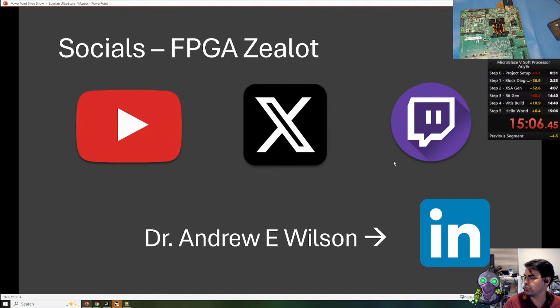Yeah. Oh, so now a YouTube comment about setting up the Ethernet in the SoC. Yeah, the next example, I would love to do that. We do need the HyperRAM for the LWIP library. If we want to support the whole UDP TCP stack, we need more instruction memory space. But that would be a great example to show.